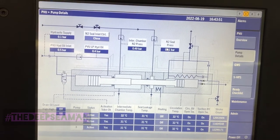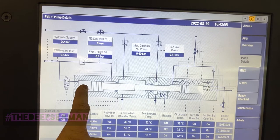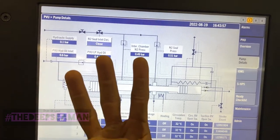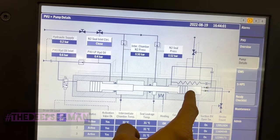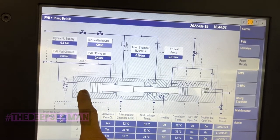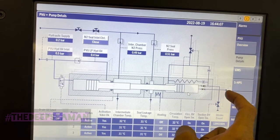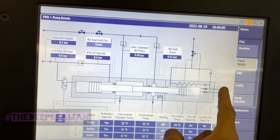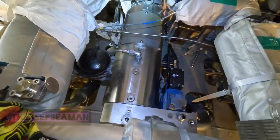Quick run-through summary: this is the cryogenic pump, hydraulically driven, single cylinder, reciprocating. We have three single-cylinder pumps. Cold end and hot end - hydraulic oil at 225 bar inlet, released by the spring oil. Cold end inlet at about 5 to 6 bar, discharging at 380 bar of cargo ethane.